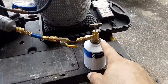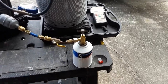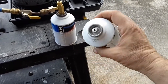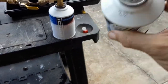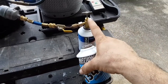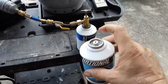This is my tap for the little cans. The newer cans come with a self-sealing top. This one here happens to be from National — not a sponsor. It actually has its own self-sealing top. You can't really see it because it's dark in there, but there's like a little push button in there — kind of like a Schrader valve. When you plunge that down, it doesn't necessarily have to make a hole because there's already a hole there. All it does is push it down, and then you back off a little bit and it releases the refrigerant.